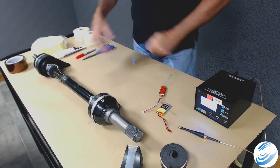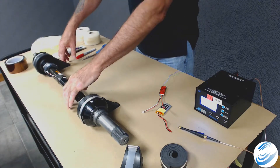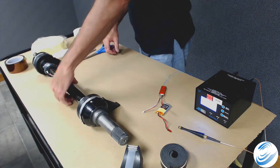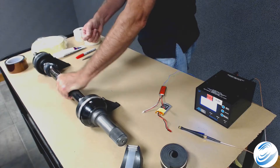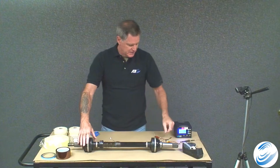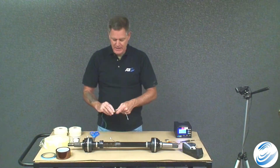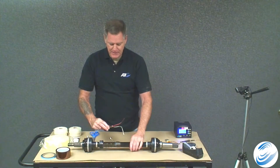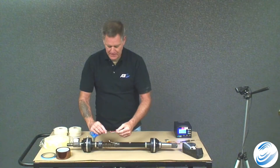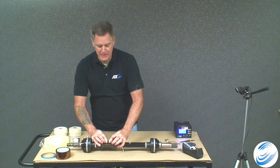On the table there are two little brackets that hold the shaft in place. You could also use a piece of wood or another individual to hold it, since you'll be rotating the shaft and pulling on the tape at the same time. Once that's in place, take the transmitter, put the metal plate down onto the shaft, place it to one side of where the strain gauges are, and firmly press it into the double-sided tape.